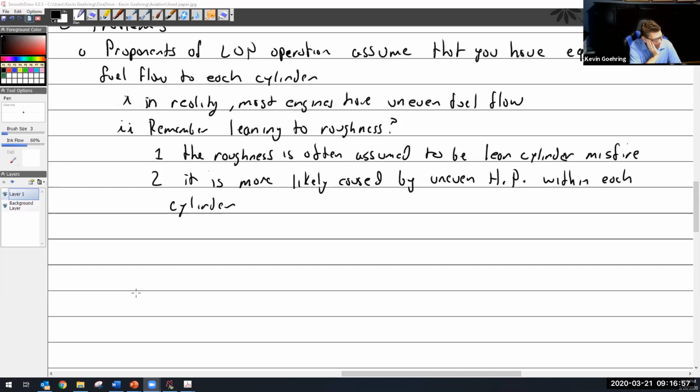Oh man, I fly this thing exactly like the pilot operating handbook, the POH. You know, what do you recommend I do? And then you think back and like, oh yeah, you should run 50 degrees rich of peak. That way you're not running at peak. A little bit of extra fuel is going to help cool that engine because fuel is cooling. I learned this from my textbook.